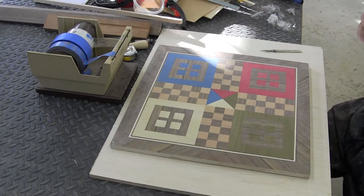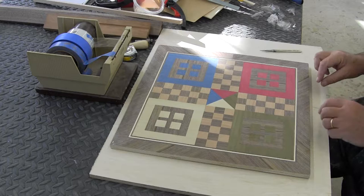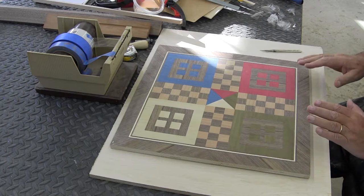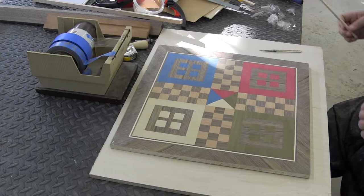This is a game board that I completed, and this time I'm going to edge the veneer and actually capture the veneer on the top — as opposed to putting the edging on first and putting the veneer on top of the edging. This time I put the veneer on first and I'm going to put the edging on like so.